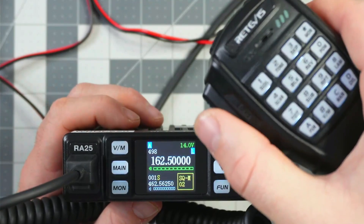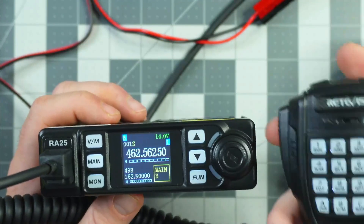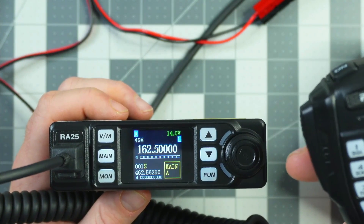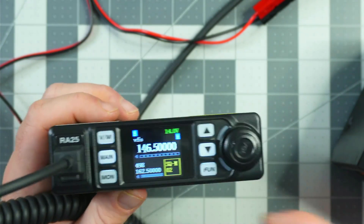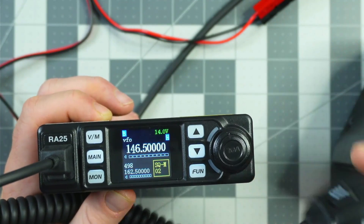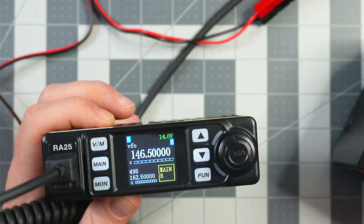If I turn the scan off and page down to the 400s, I get the NOAA weather radio — so I still have access to NOAA severe weather alerts. I believe that was a good modification. And if I try to transmit on those channels, it won't allow it. Now let's go to the VFO: hitting the C button on the keypad swaps between channels and VFO mode. Even in the amateur radio bands in VFO, I won't be able to transmit.